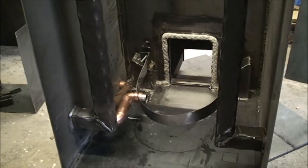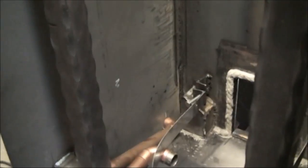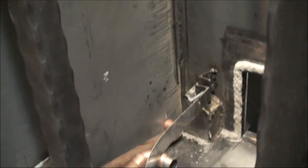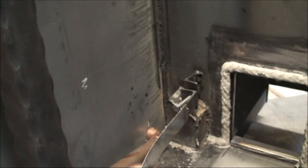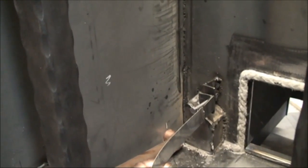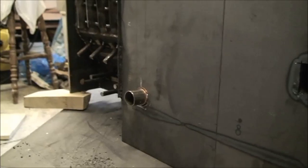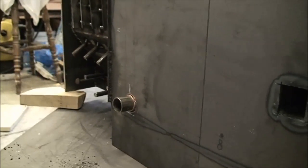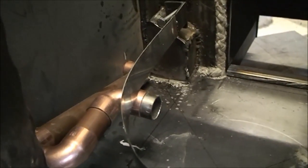Everything's welded up in here. I've put the secondary air pipe in — that's a piece of 28mm copper. I've not soldered the fittings together because I think the solder will just melt, so what I've done is roughed the pipe up so that the fittings are really tight — just pushed on with the hands, really tight fitting so they're not going to come undone. It enters through the side there, the secondary air, just through that pipe. There's a little bit of stainless pipe which happens to be the same diameter, 28mm, so it just slides nicely onto the copper, and there's another piece on the end there where it enters the riser tube.